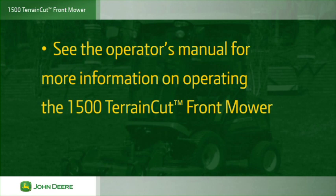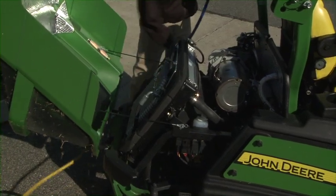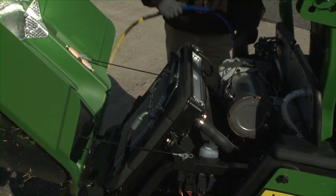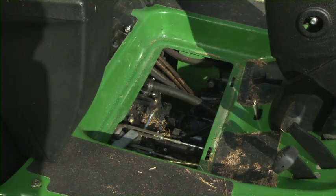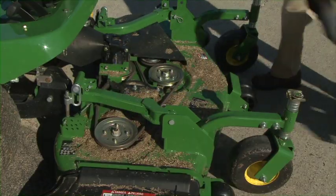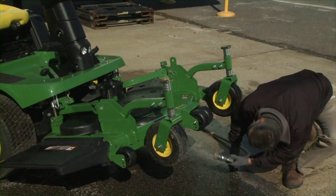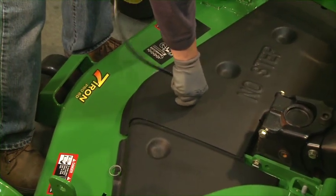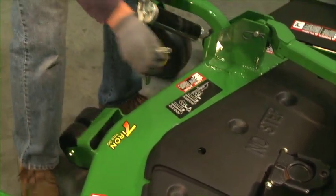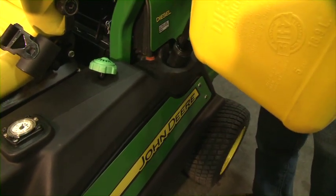After you finish mowing, there is some maintenance you should do to get the mower ready for the next day. After the engine has cooled, open the hood and use low pressure compressed air to clean the engine compartment, radiator and oil cooler. Blow parallel to the cooling fins to prevent damage, as damaged fins can reduce cooling efficiency of the radiator. Lift the footplate and clean debris off the transaxle. Remove the mower deck belt covers and remove debris. Use low pressure water to wash the cutting units; a high pressure power washer could force grease out of the bearings and damage some parts. Do not spray cold water on a hot engine block. After rinsing, lubricate the mowing deck and caster wheels. Before parking, fill the fuel tank with fresh fuel to the bottom of the filler neck.